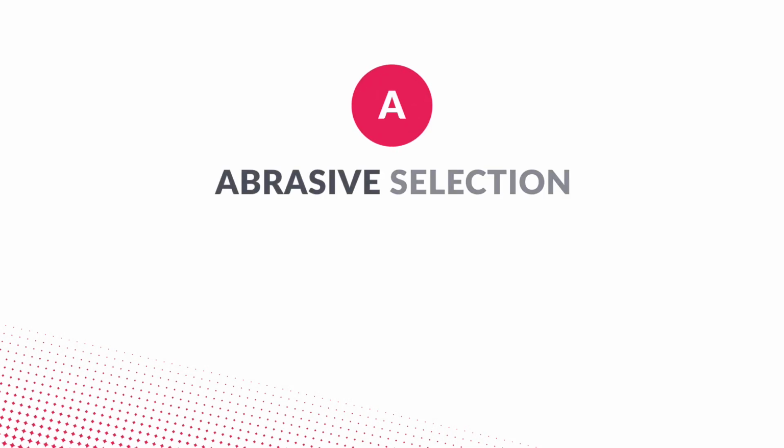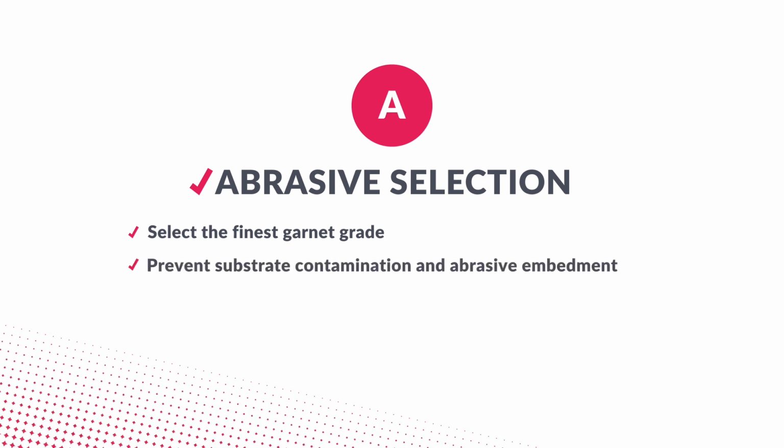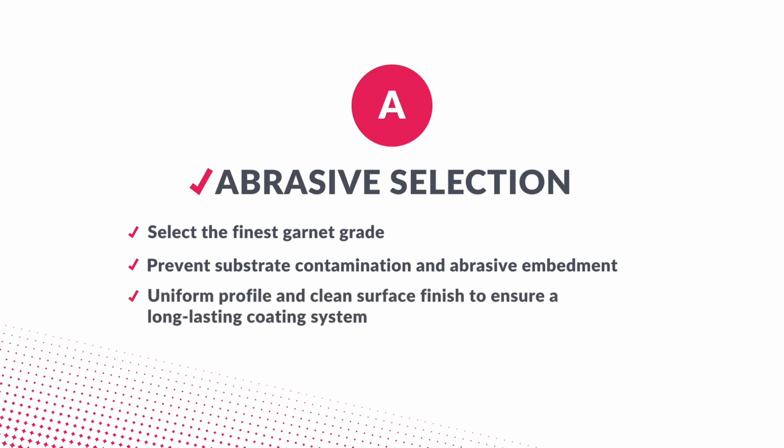In this first video of our 3-part series, we explained why it is important to select the right abrasive for your project's specific requirements. Selecting the finest grade garnet that will meet the technical specification. Preventing substrate contamination and abrasive embedment. A uniform anchor profile and clean surface will ensure a long-lasting coating system, and it is important to ensure your garnet stays dry for an effective blast operation.